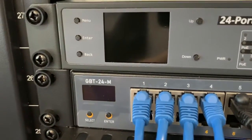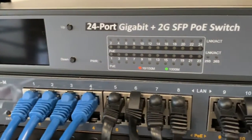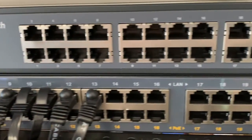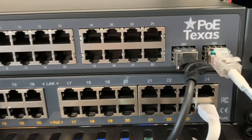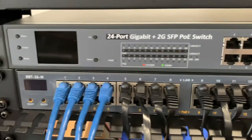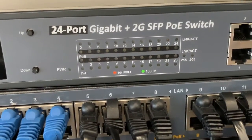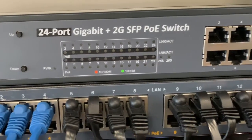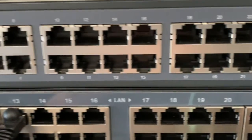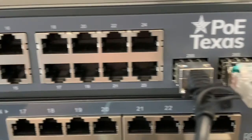This is the GPOES 24-2 55V 390W PoE switch. It's a 24-port rack-mountable PoE switch with an LCD display for on-screen management. It has an internal power supply that provides 55V 390W with a fuse limit of 600mA per port. Each port also has its own LED indicator and supports pass-through data rate up to gigabit speeds. There is an LCD screen for local display management and two SFP ports which I'll review shortly.